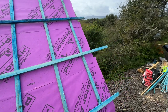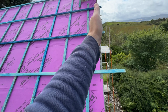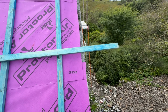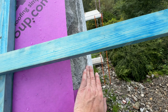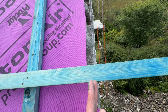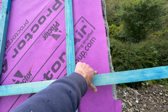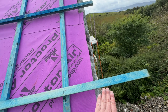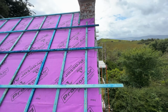We're just running the ends through now, and we'll ping a line and cut these, trying to use the walls or plumb guide. It won't be completely spot on, but it'll be close enough. What it'll have to be is just back a couple inches from the end, because there's going to be lime render build up here, and I think the lime will come to the underside of the roof sheet, so we'll probably cut it back a wee bit. And I'll judge whether we put a fixing in there into the stone, that's quite solid actually. What we're worried about is wind uplift getting under the verge, because we don't have a fascia board or anything to fix onto, but I'll do the job.